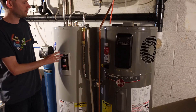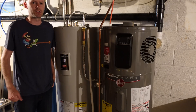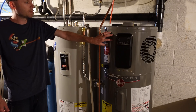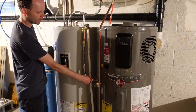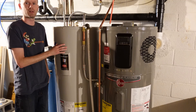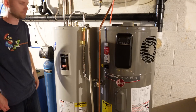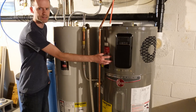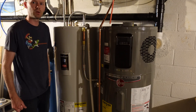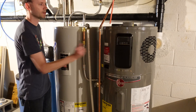The plumbing has been finished for a couple of days now. The way I have this set up is the cold water comes into the heat pump water heater first. The water then exits on the hot port and goes into the inlet on the electric water heater, which is currently still on-grid. Then the water exits the electric heater and goes up to my hot water supply. There is no power connected to the heat pump yet and everything is completely on-grid. Today I'll hopefully finish this up, shut off the electric heater, and have all my water heated completely by the heat pump heater.